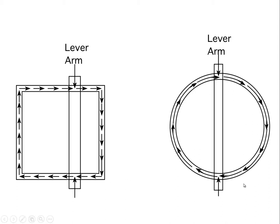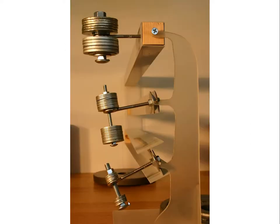And that happens in the case of round tubes. We can couple that force arrow with this force arrow over here, or that force arrow with that force arrow. And in every instance, we end up with a fairly substantial lever arm for the force arrows. So that would lead us to believe that the ability of these closed sections to generate internal resisting torsion will be much better than in the case of the I-beam.